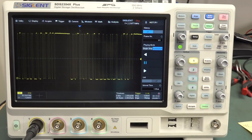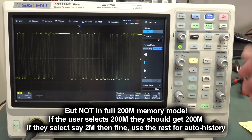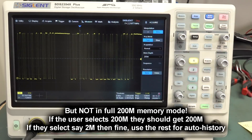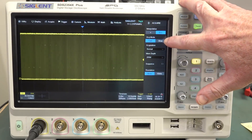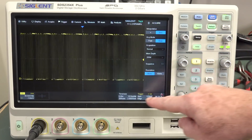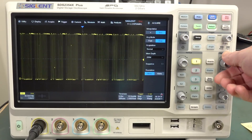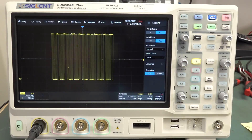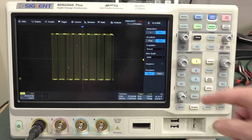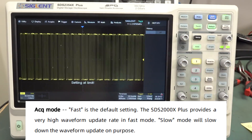Why? That's an insane choice. Why would you do that? Please, somebody at Siglent who designed this thing, tell me why you would make that choice. Fair enough, I'll give it to them in run/stop mode — automatic history mode, some people might even think that's kind of cool. But when you hit single shot mode, I would want my full 200 meg of memory or whatever memory depth I've chosen. A couple of people asked about the acquisition mode — does fast or slow mode have any effect? No, slow mode makes no difference at all. Single shot capture works exactly the same way. The slow mode seems to just slow down the updating — you don't get any extra benefit in terms of memory. History mode works exactly the same in slow or fast mode, and the manual implies this as well.